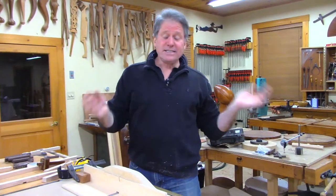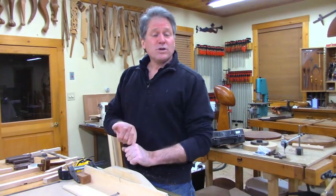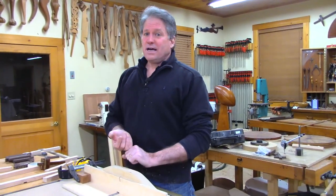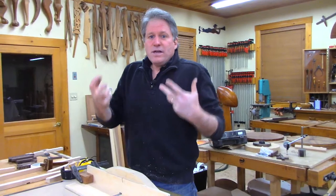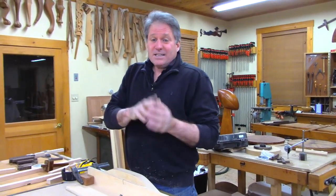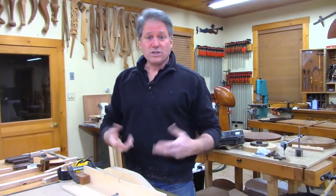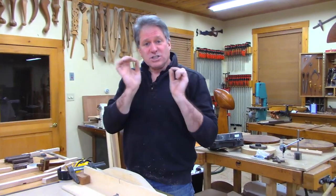And I looked at it, and it's as tight as it was when we set it up. So that's not true in all cases. You've got to definitely make sure you're working with dry material. I suppose if you built it in the humidity of the summer and fit it nicely tight, there's a chance that in the dry heat, like around here right now, in the dead of winter, it would shrink and you'd see a little gap there.